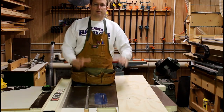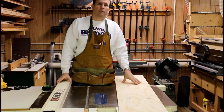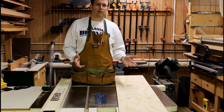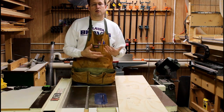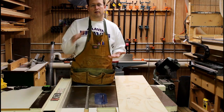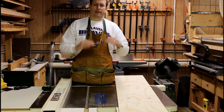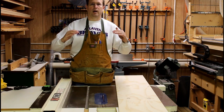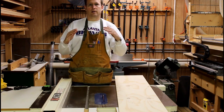So I was making the pedestal around the base of the columns, and I did that the other day out of some wood we got from Home Depot that is finger jointed, pre-painted. In the humidity, it would really turn because all the boards that put them together, they had the grain, when you look on the end, all cut the same way. Instead of working against each other, it all worked together to really produce a huge curve.